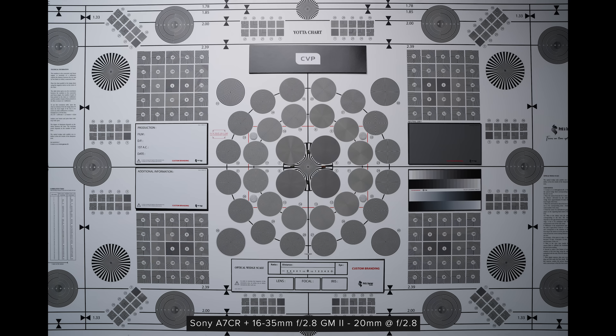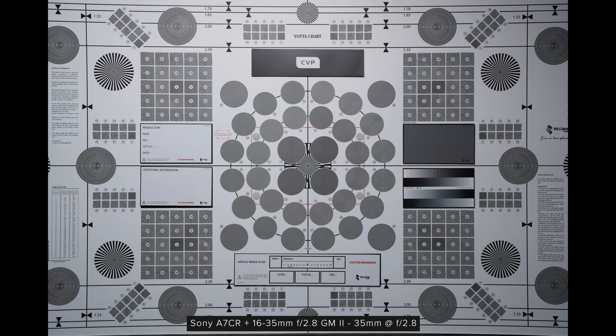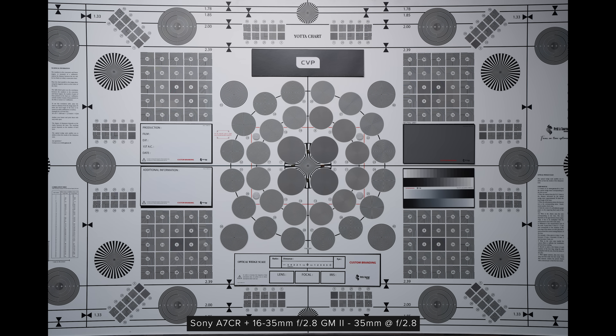Looking at our chart tests, we can see slight barrel distortion at 16mm, which slowly corrects and then turns to slight pincushion as you hit 35mm. We can also see that it resolves incredibly well across the frame and zoom range. Even wide open, it's very sharp with good contrast. It has a touch of chromatic aberration in the corners, but this is a very small amount. When it comes to bokeh, it's pretty consistent throughout the zoom. Our out-of-focus highlights have a defined edge with minimal colour fringing and some onion skinning. It is decently shaped wide open with some cat's eye shape towards the corners, which is more noticeable at the longer end. As you stop down, the 11-blade iris keeps highlights decently circular, which is nice.